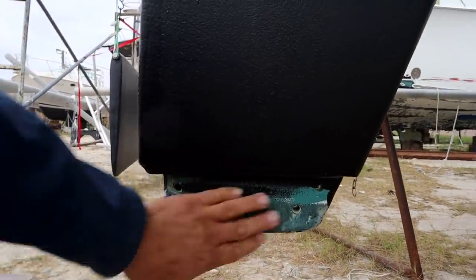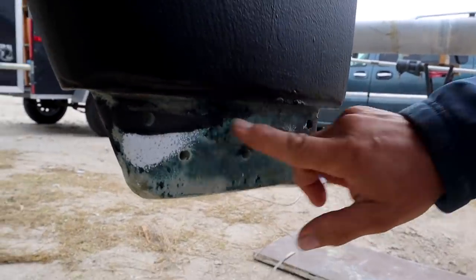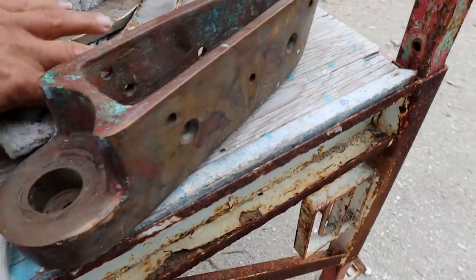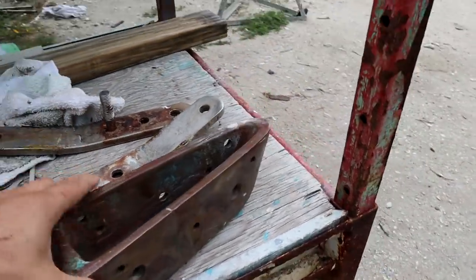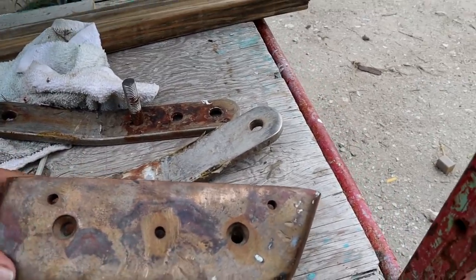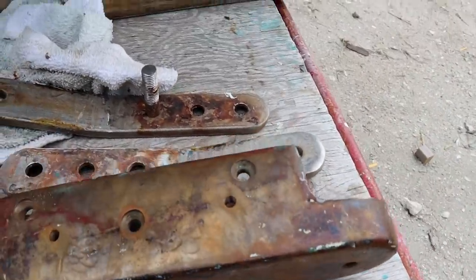Here is our area that it goes on to right there. I'll probably sand off this black paint because it's got copper in it. And here is the rudder foot right here, so it fits inside of this hole right here. The rudder pin goes in there, that pivots the rudder. And then these holes right here go straight across - I had to drill those out and I'm going to re-tap those holes and make sure there's a clear path all the way through.